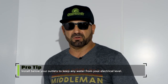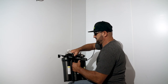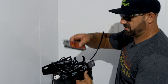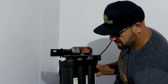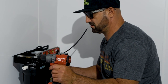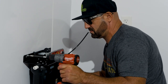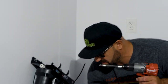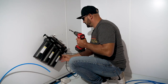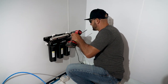I'm going to mount this whole unit below the power line to make sure all my water lines are below the electrical outlets. Grab your drill, take this off so I can see where level is. I've already pre-drilled a couple of holes. You want to make sure you don't mount this directly at ground level — you need a little bit of space underneath it.